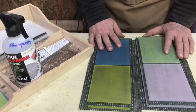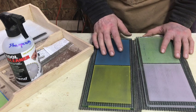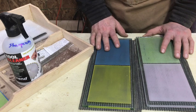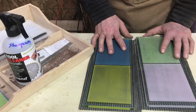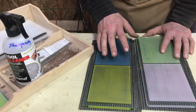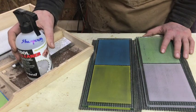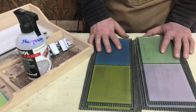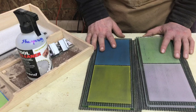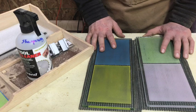Jonathan Katz-Moses made a video the other day going over this, and I've been using this system for probably a year and a half, 2 years. I've only had to buy a few pieces of replacement paper, and I sharpen my chisels and planes quite a bit. It's very cost effective if you're not someone who can afford to put a ton of money in up front, but wants an incredibly flat sharpening system. Just a little lubricant, and personally I use a jig, and you're good to go. I use this to flatten the backs of my chisels as well. It lasts quite a long time, and I get incredible sharpness, you know, mirror polish finish, no problem.